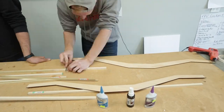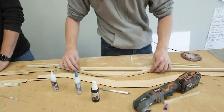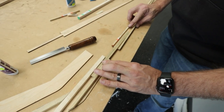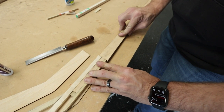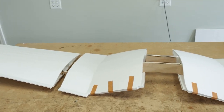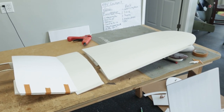We really learned a lot from building the spar. This one was only made of quarter-inch poplar, and we're going to do the center section out of half-inch. The fact that the quarter-inch held almost 80 pounds is incredible. The outer panels will still be quarter-inch poplar and they'll slide right into each other. A really cool thing about this wing is it's a three-piece removable wing, which gives us the ability to transport and travel with the plane.